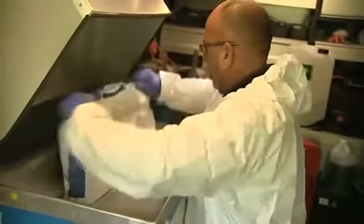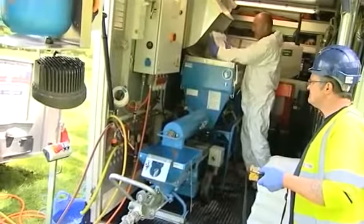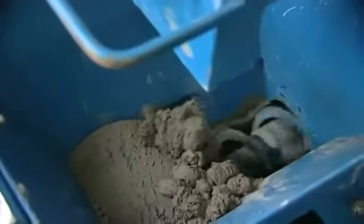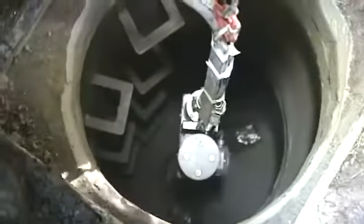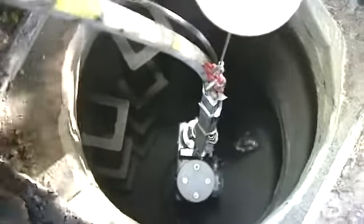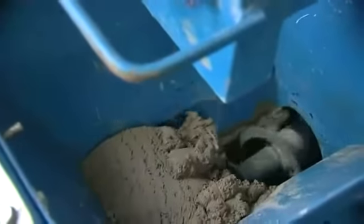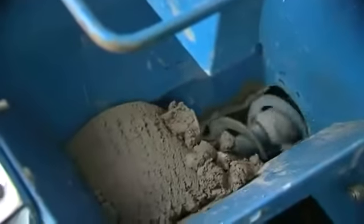It's a different material again, KS1, an all-in-one mortar used specifically in water supply and sewerage installations. Moisture control is crucial here, and an integral system in the trailer adds the water, does the mixing and delivers the mortar to the pump. If this was a different setting, other specialised products could be used to protect against acids, H2S corrosion and all manner of chemical effluent ranging from pH 1 to pH 12.